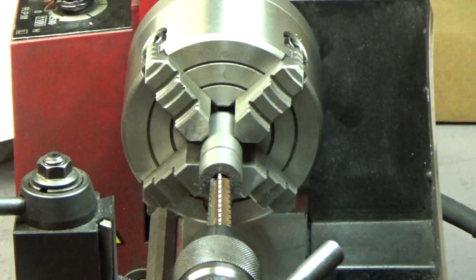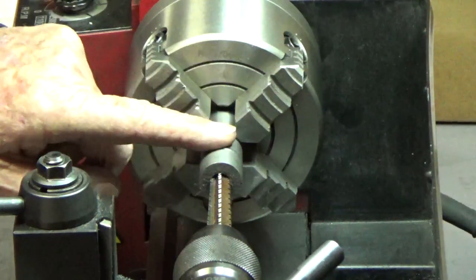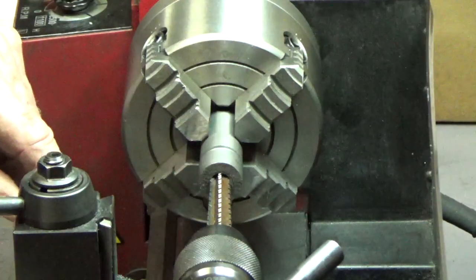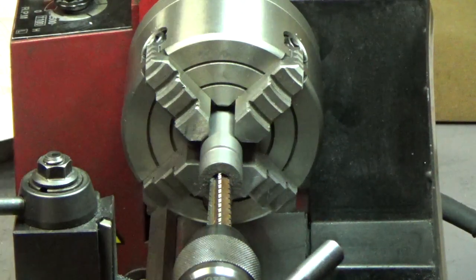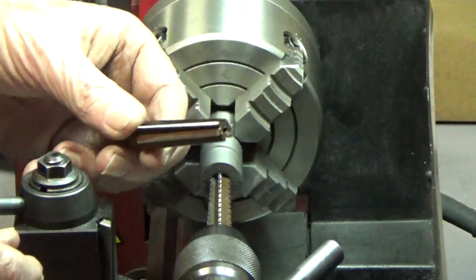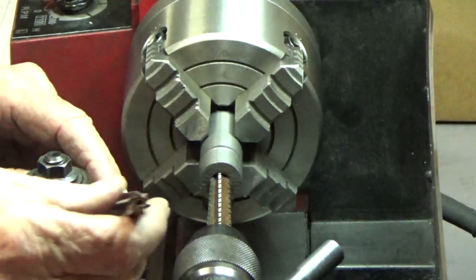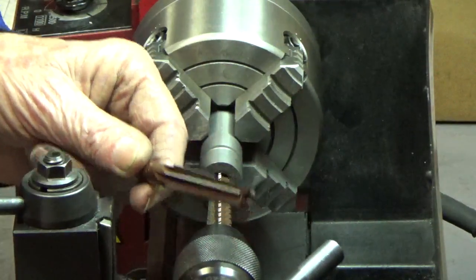What I've done so far to prepare for this is I already had a test piece — a test quill piece that I'd turned in the lathe previously. All I did was chuck that up and I drilled, I think, one size under 3/8 inch hole in here. I purchased some reamers from Banggood.com. This is an MT1 reamer — this is the finishing reamer. I have the roughing reamer chucked up right now.